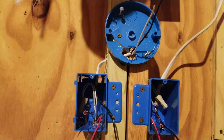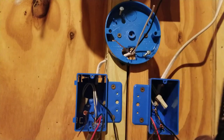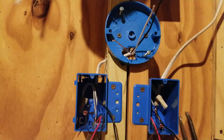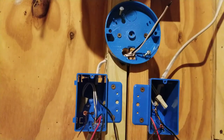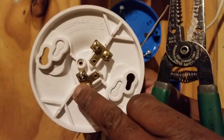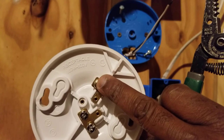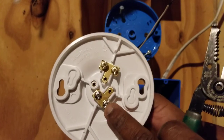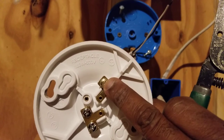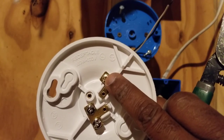The light I'm using is a plastic keyless fixture, and the box is also plastic, so you don't necessarily need the ground here — the ground is only needed when terminating something metal to prevent it from becoming energized. So we'll cut this ground short to keep it out of the way so it won't come in contact with the screws. We're going to land our white wire on the silver screw and our black wire on the gold screw.